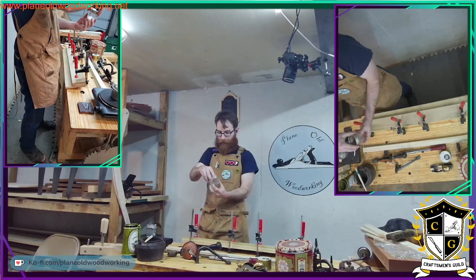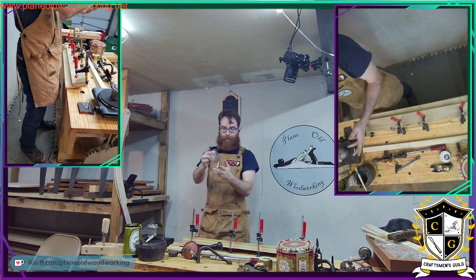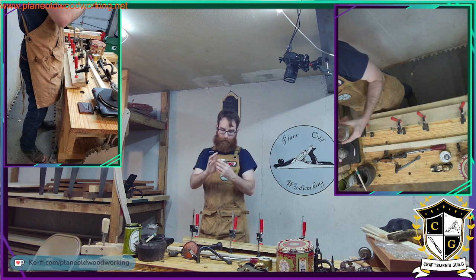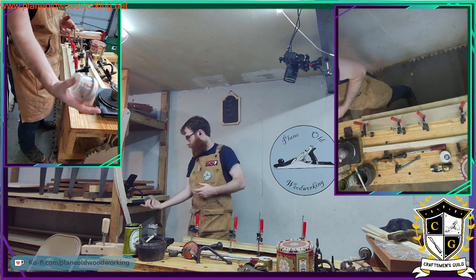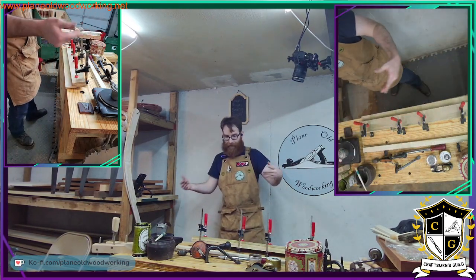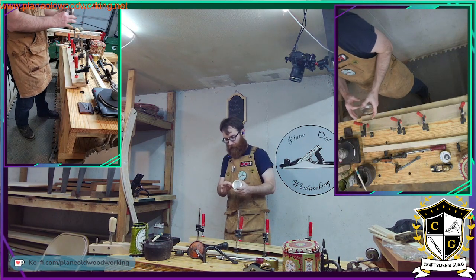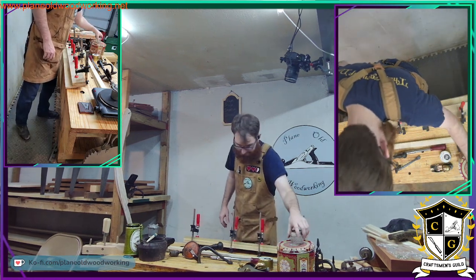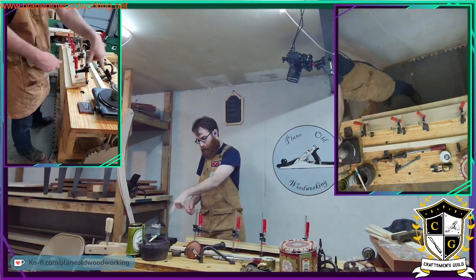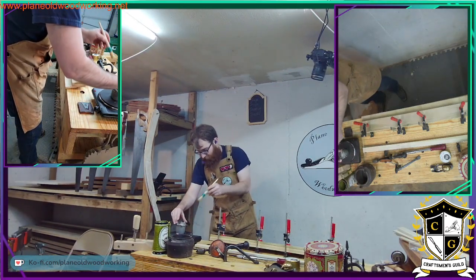But what I do is, at the end, I just pour it in these little ball canning jars. What are these, like 8 ounces, maybe? 6 ounces? I just write hide glue on it and throw it in the fridge. I didn't have any prepared today, or actually, I had some in the fridge, but I had to throw it out because it finally started molding. But basically, if I have some in the fridge, I'll pull a glob out, throw it in, and let it heat up. And maybe throw a little water on top of it in case it's needed.